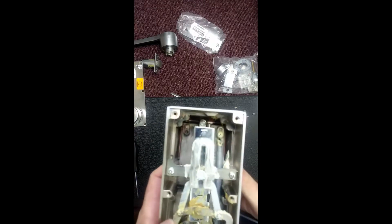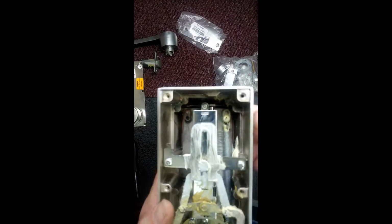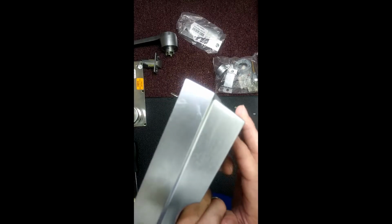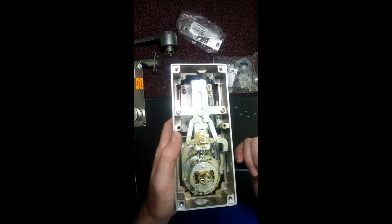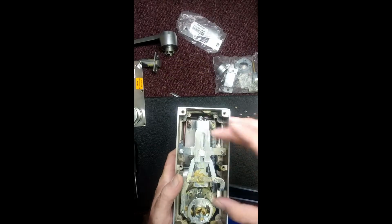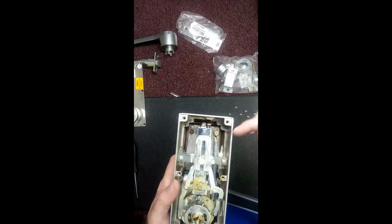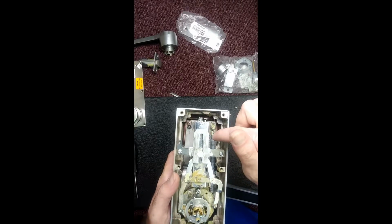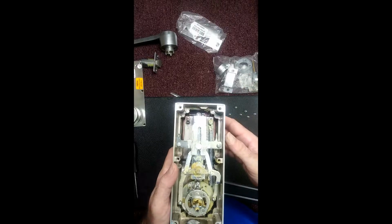If it was bad, you wouldn't hear the click. In fact, here, if I hit the button again, you don't hear that click. And that's the lack of sound that I was referring to. They have little tiny springs that control the cogs related to the buttons, and usually what ends up happening is the springs end up stretching out and then they no longer work.